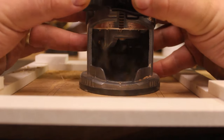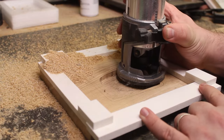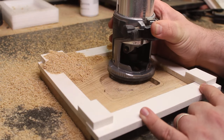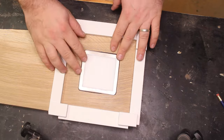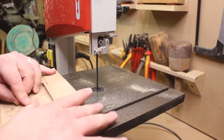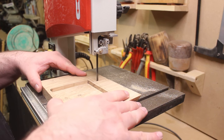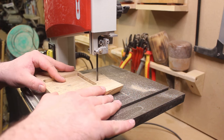You'll notice I've not cut out the outside shape of the lamp at this stage — I'm keeping the whole board. This means I've got somewhere decent to rest the sides of the router on. Once I'm happy with that and test the fit with the panel, I can then take it over to the bandsaw and cut out, just outside the lines, so I've got some room for sanding and don't accidentally get it too thin, because I'm looking for quite a thin edge around the LED panel.